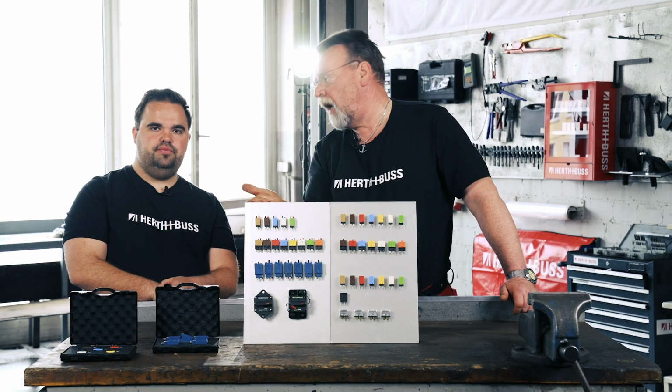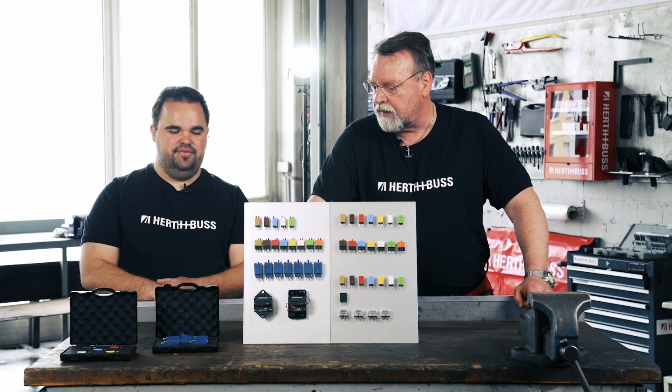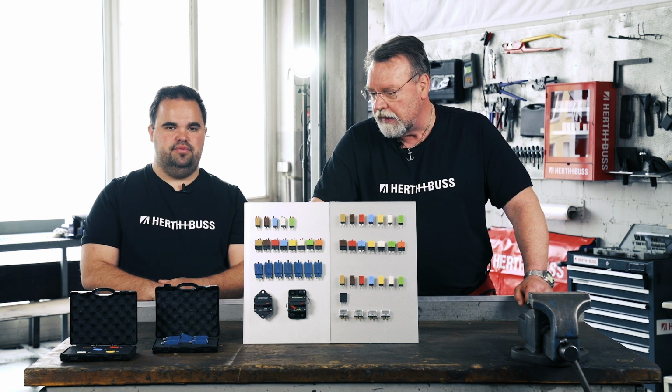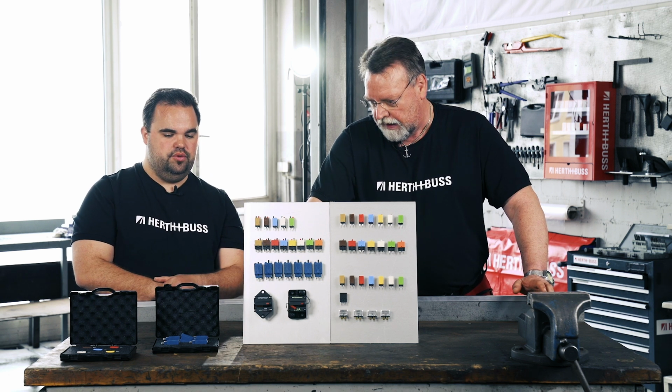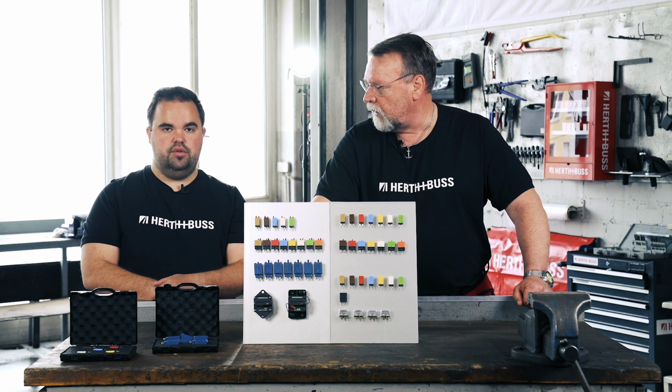Firstly, if I insert a fuse into the faulty or short circuit, I always have arcing. As long as only this little flag burns away from the fuse, then everything is okay. But if, of course, it's the circuit breaker or the fuse box, then the damage would be greater. That's why we both recommend our 2 repair ranges with circuit breakers for repairing electrical systems.